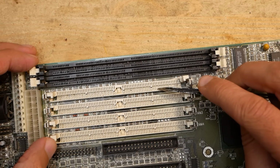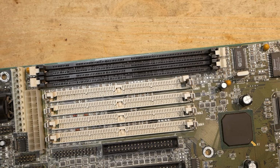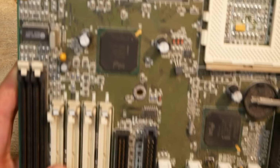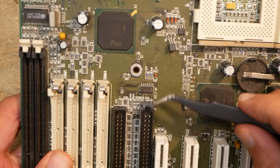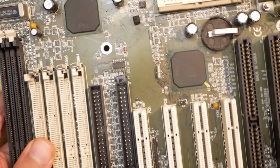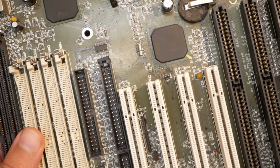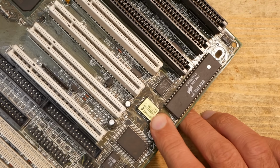The upper two 72-pin RAM slots can be replaced, but I have to look if I have replacement parts at hand. Maybe desolder those from other broken boards in scrap. Another very minor damage is this plastic IDE connector. Nothing to worry about, otherwise I don't see any damage. At least nothing jumps into my eye so far. The board is just very dirty and sticky though.